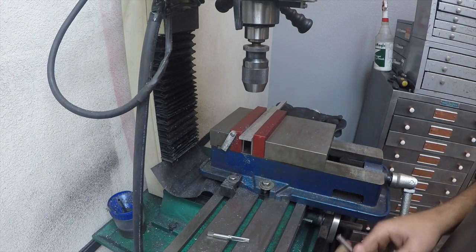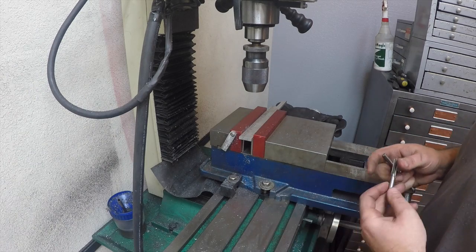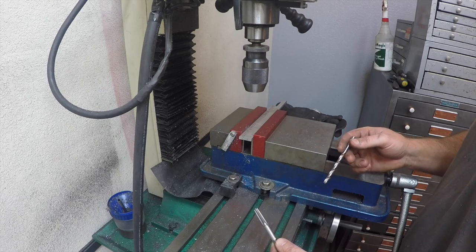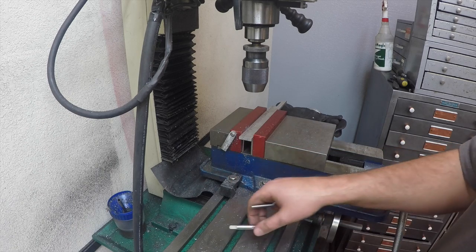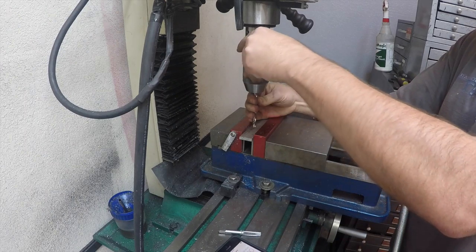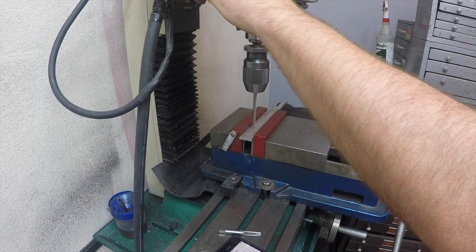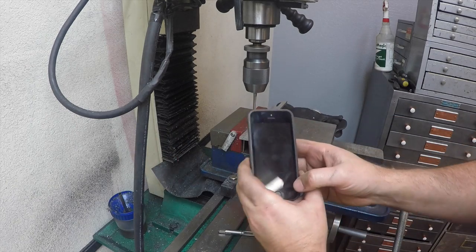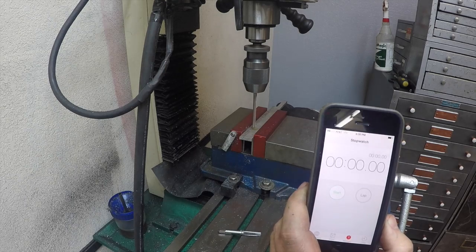We've got a piece of quarter-inch aluminum and we're going to drill a couple of holes. I've got a 5/16ths tap — Letter F is the drill bit size for a 5/16ths tap. We're going to drill two holes in it: tap one by hand and one on our new tap holder in the mag drill and do a power tap, and see which one does it faster. We'll run it at 2,000 RPMs with a dab of cutting oil.